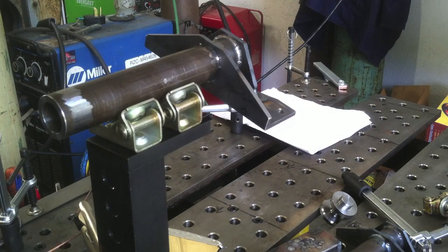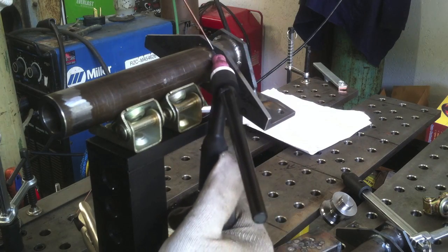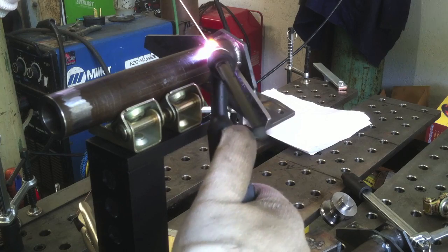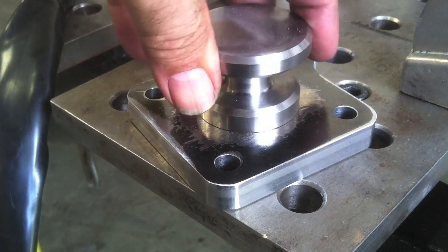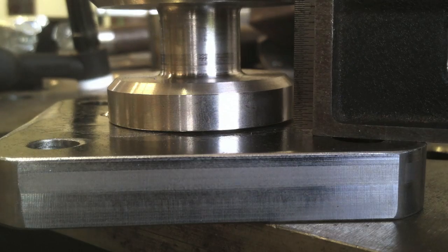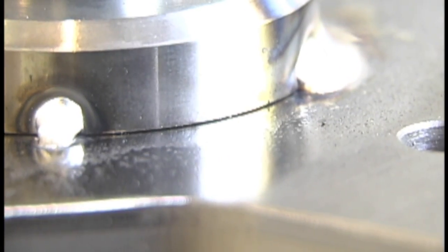Those magnets are strong enough that I can rest the cup and walk the cup on it without moving the part, even if I put a little torch pressure on it. So I'm going to walk the cup on this joint — again leaving the wire in the puddle, just walking and wiggling it back and forth, keeping a tight arc and a little pressure on the rod to keep it pushed in the puddle. Now this piece needs to be straight — if I just tack it and weld it up it could get crooked. See how it's pulled with just a tack on one side? It's not a lot but we don't need that. So just clamping it with these half-C clamp type things from the tooling package — very easy to lock them down with one motion, then tack and roll them up.